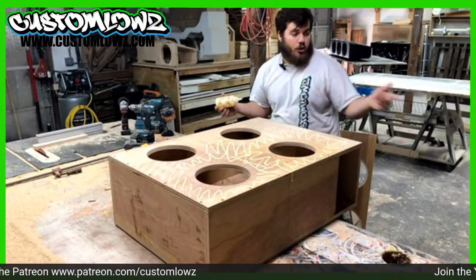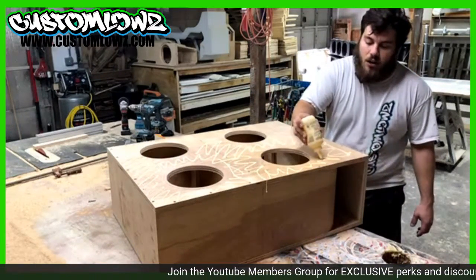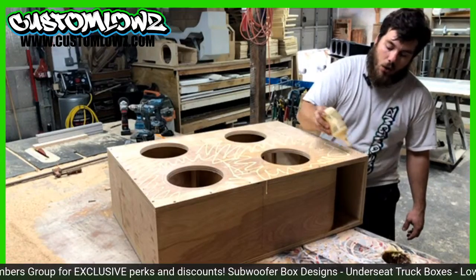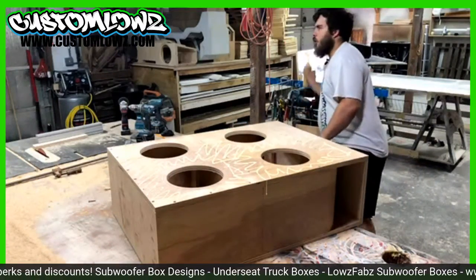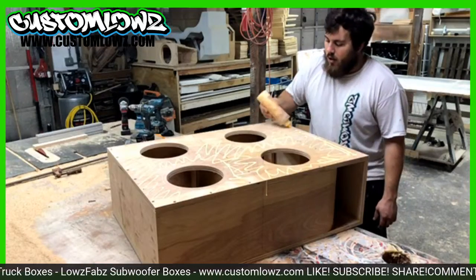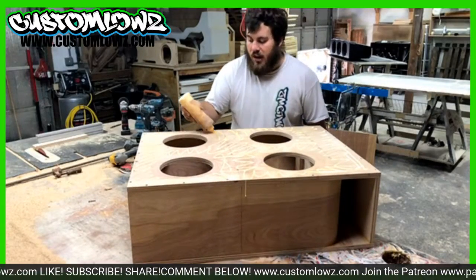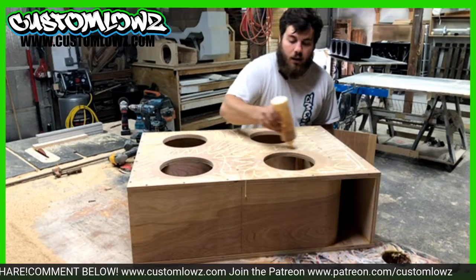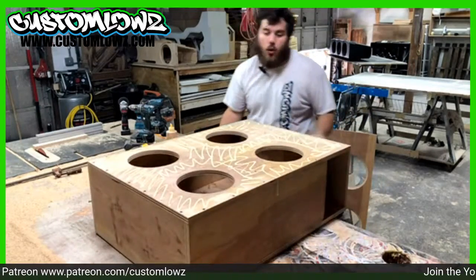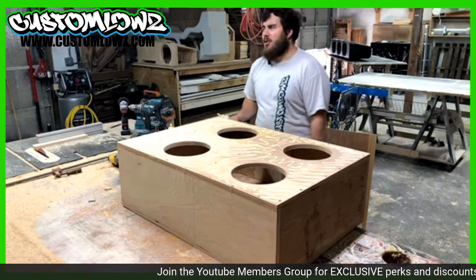I've recently been using, in my flush trim bit that I just used, or when you guys saw me cutting out the window brace the other day, a Whiteside 1/4-inch spiral flush trim bit, which is the first time I have ever used one. I've seen a whole bunch of fabricators use them, but I also noticed they always tended to use them on MDF. I figured that with plywood you might have too much chatter for the bit to last. But I realized they're so damn sharp that the chatter is reduced like tenfold. It's the best bit I've ever bought, for sure. Whiteside, 1/4-inch, spiral, flush trim bit. It's amazing, and I think it was $40, dude.